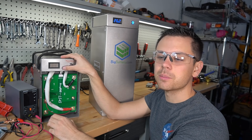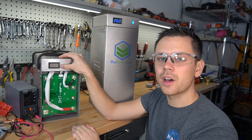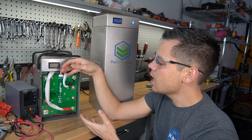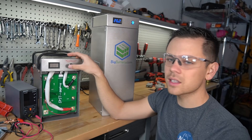That was the only concern I had with this battery when I first did the teardown and tested it. Previously the company thought that these cells could be charged at negative 20 degrees Celsius and they were incorrect. I got the data sheet and the number said zero. So it's nice that they did this update.